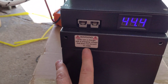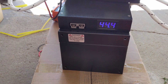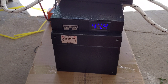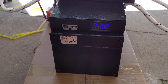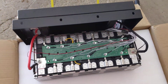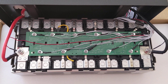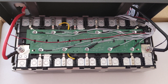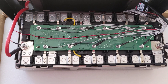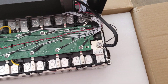That's interesting. There's a sticker that says do not exceed 51 volts. I think these are lithium ion cells, so they're 4.2 volts per cell, 12 in series. This is the inside — it's some kind of Samsung module. I'm not sure what it's pulled from. They just took the BMS leads and tied them down on the inside along with a positive and negative lead at the output of the BMS.